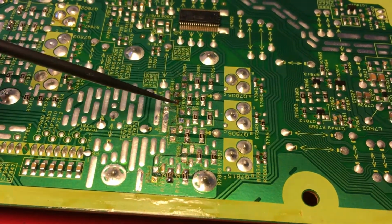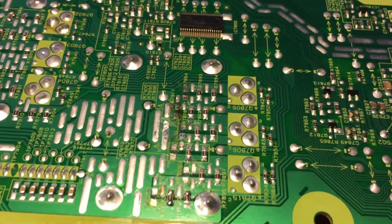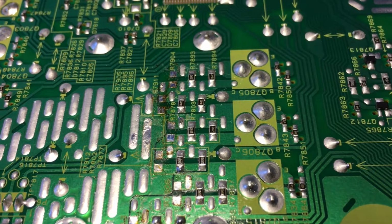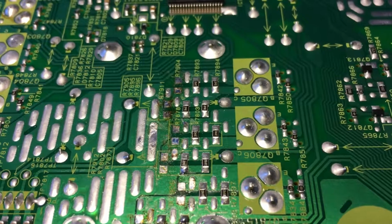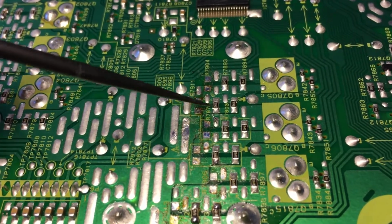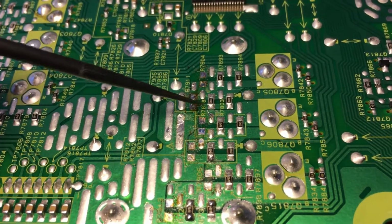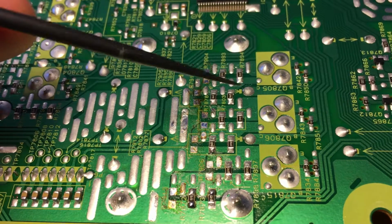So there are 6 resistors here, and the overall resistance is very low because there are so many of them. If the resistance is low going to ground, that will create a higher voltage across the LED light strings, and the LED lights fail too soon, prematurely. However, if you increase this resistance by removing some of those resistors, you will increase the overall resistance in that circuit, which in turn reduces the overall voltage across all the LED light strings.